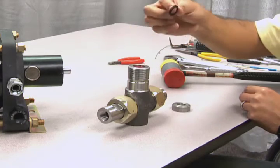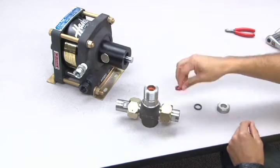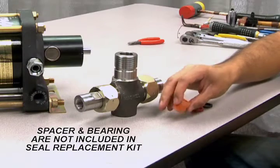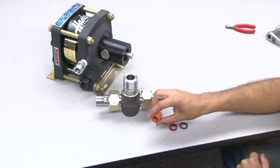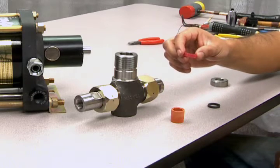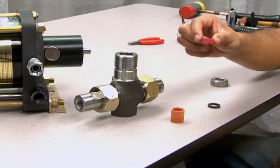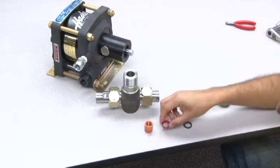Inside the T-body you will find the small bearing, a cup seal, and the internal spacer. The internal spacer and the bearing will not be included in your seal replacement kit, but you should inspect both of these parts for wear or damage. The cup seal will be included in your kit along with the packings for the check valves. Refer to the hydraulic check valve and seal package lesson to replace these parts. Remember to refer to your operation and maintenance manual for proper parts and model numbers.